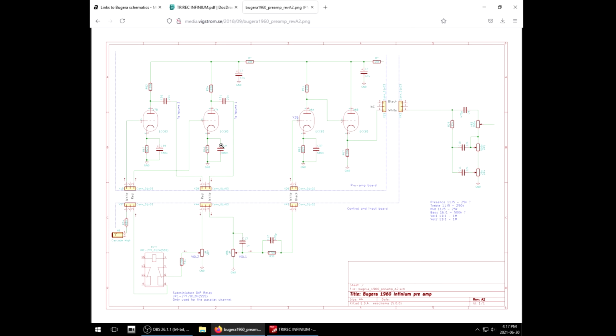Instantly, you could get some JCM 800 tones out of this. However, in the JCM 800, normally this gain stage here would be a cold clipper, a 10K with no bypass. That's not the case here. So this thing actually has well more gain than the JCM 800 stock. In fact, that's something I like about it. The JCM 800, I have one. It's a good amp, but I can't play it without something else plugged into it, like a pedal and overdrive.